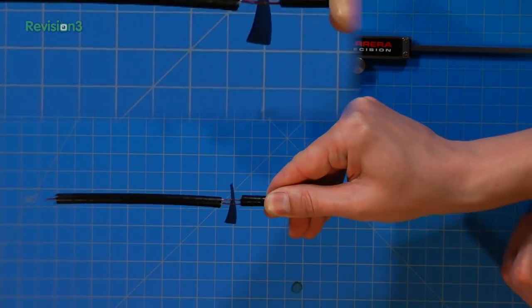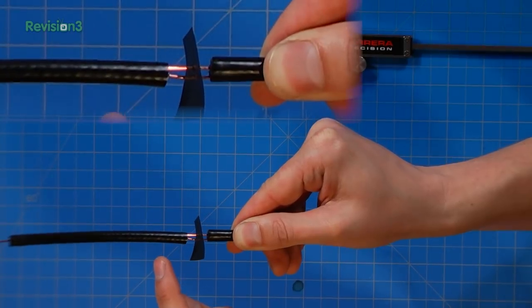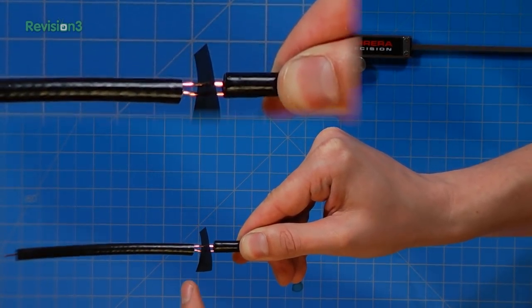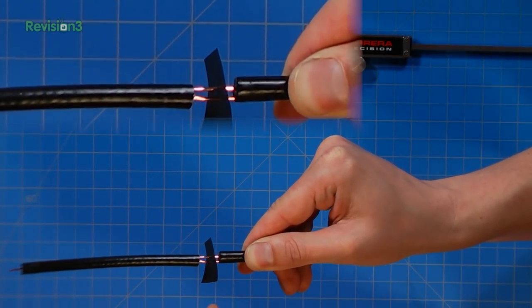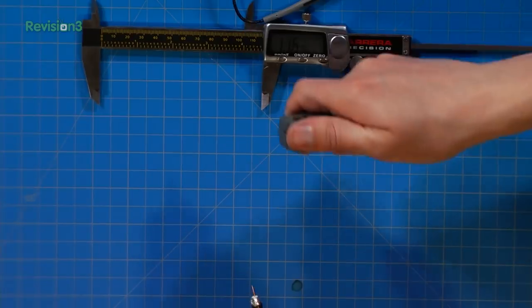And if you look real tight on there, what you can see is neither of your copper cables are touching each other. Nope. But the copper to aluminum on that guy, and the copper to aluminum on that guy. And when you say aluminum, you're talking about the inside of the outside jacket. Right. So if you were to take this completely apart, in fact, I believe with this I should be able to trim off just the right amount. Let's see. Put that to there, squeeze that, pull this guy around a little bit, peel that off.